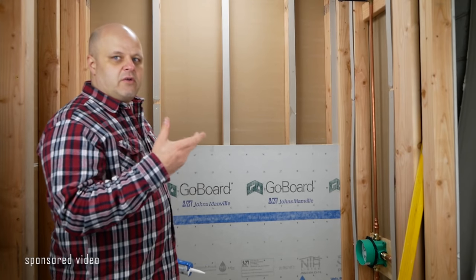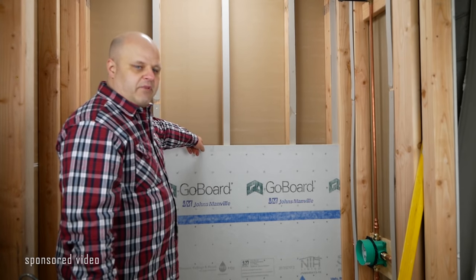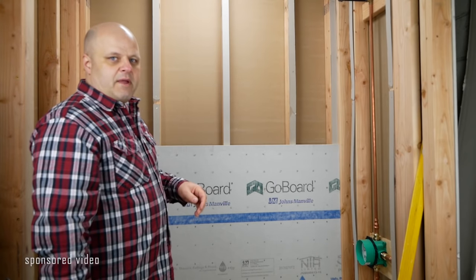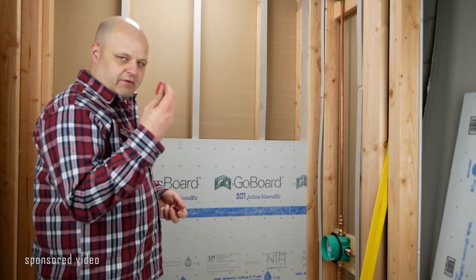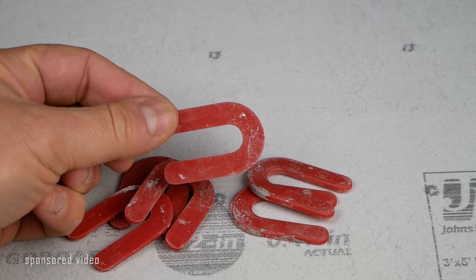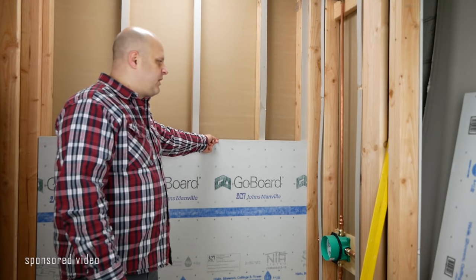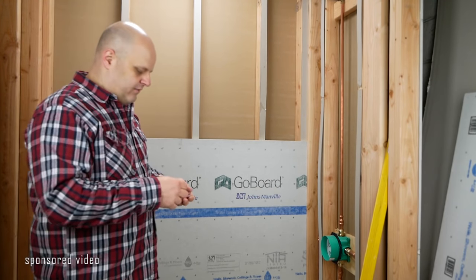What is critical when doing it that way — putting the board up first then applying sealant — is making sure all the gaps are there, because the sealant needs to get inside between those gaps. We need an eighth of an inch gap everywhere. To keep that spacing I'm going to use eighth-inch horseshoe spacers. These are for tile and come in eighth-inch, sixteenth-inch, three-sixteenths, and so on. I'll use the eighth-inch ones in between the sheets, in the corners, underneath on the tub flange — everywhere we need an eighth-inch gap.